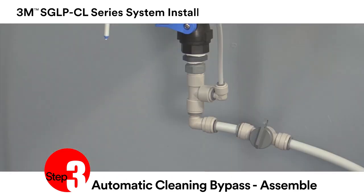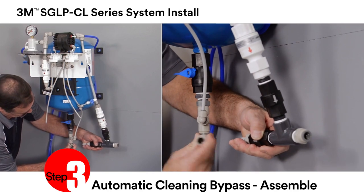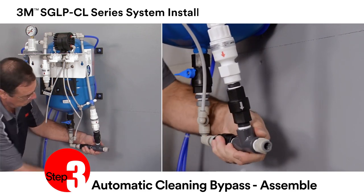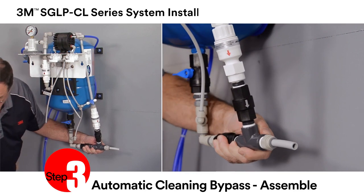Connect one end of the cleaning assembly into the fitting. Remove the 1/2-inch shutoff valve and tube that was previously installed in the bottom of the tank. Then connect the left side of the automatic cleaning bypass into the elbow. Reconnect the 1/2-inch shutoff valve and tube that was previously disconnected into the right side of the automatic cleaning bypass assembly.